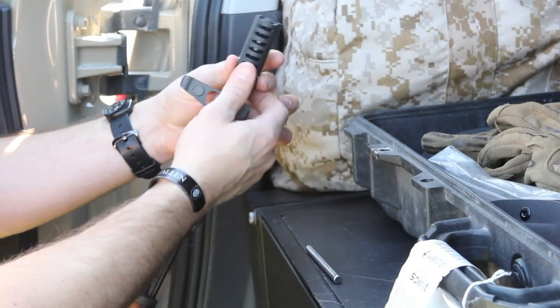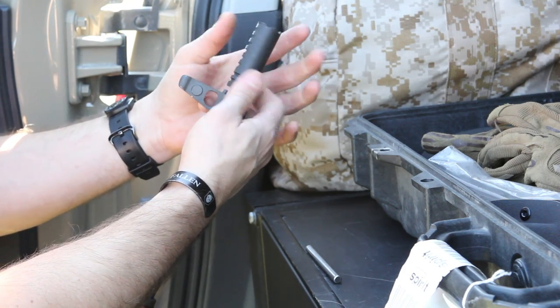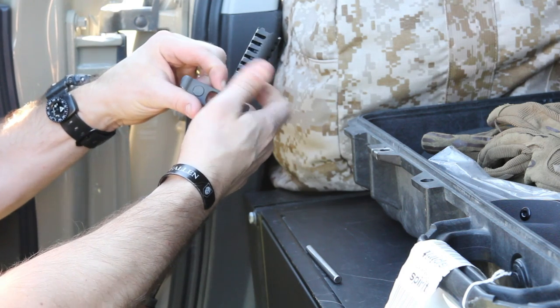When we first tried it, I was really amazed at the difference. It makes a 7.62 gun feel like a 5.45 gun, honestly. Is this brake available for a 5.45? No, it is not — you could use it, but it's designed for the 7.62. I haven't tried one on a 5.45 yet because they're threaded 14x1 left-hand for your standard AK, and most of our 5.45 guns are threaded 1/2x28.